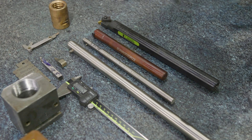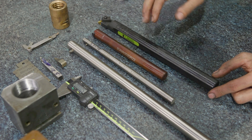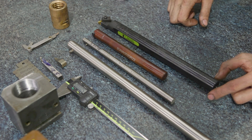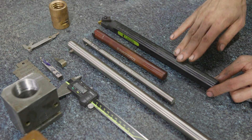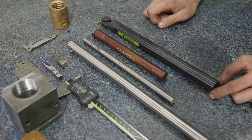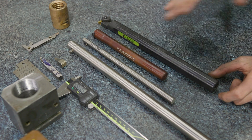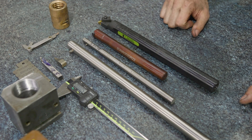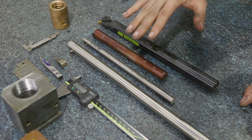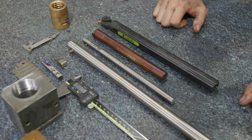100% the best option is something like this. They make multiple options — I have two different options here — and both are insert tools. They're quite expensive because you have to buy the holder and the Acme inserts, which are pretty pricey. But they're the best because these inserts are exact dimensions. If you break one or have an issue, all you have to do is swap it out. You don't have to worry about sharpening it, clearance, or anything. You set the tooling up, get it squared off, and you're ready to cut.